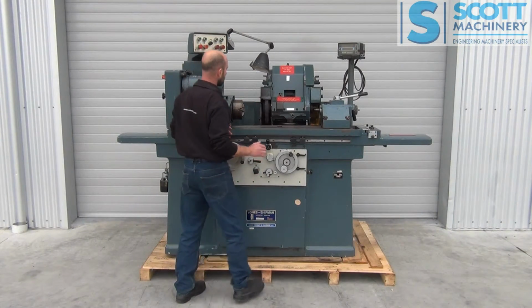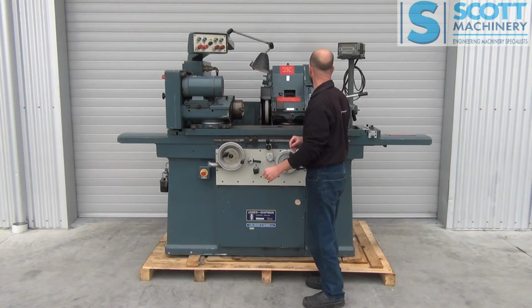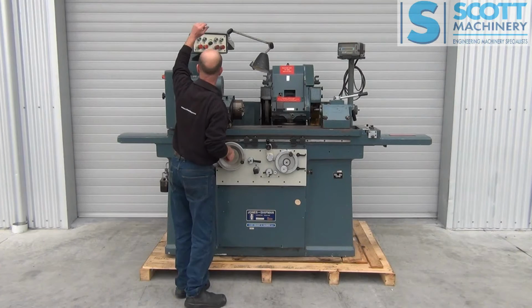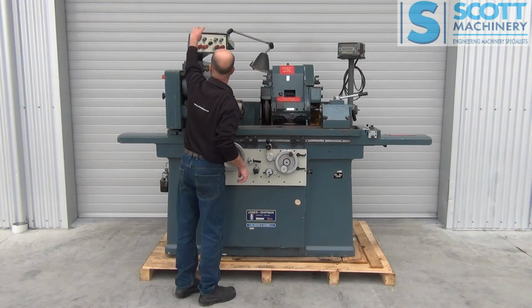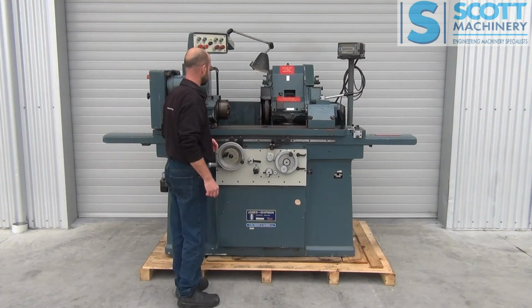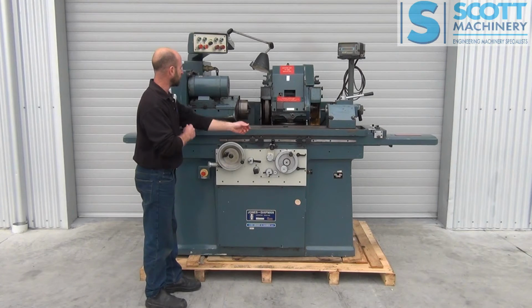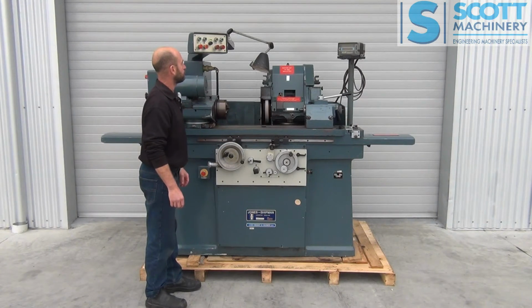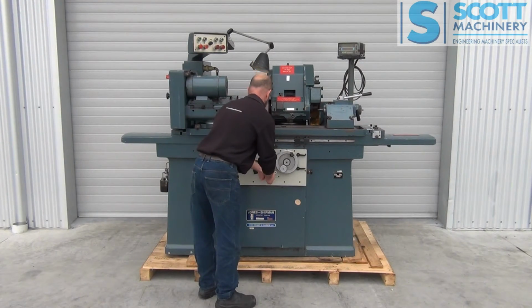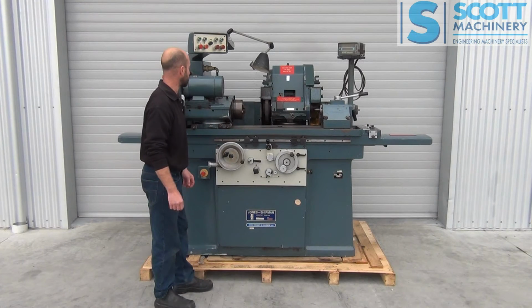There's the wheel running there. It's got a wee sight glass that tells you it's got the pressure working, and I can see that there. It's very quiet and ticks over nicely. Alright, I'll start it all up. So there it is, all running really. The traverse, the chuck and that wheel head. Oh no, I haven't got the in-feed going. Let's see in-feed now. Yeah, so that's in-feeding and showing up on the digital readout.